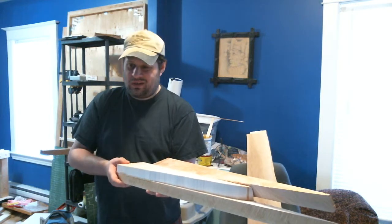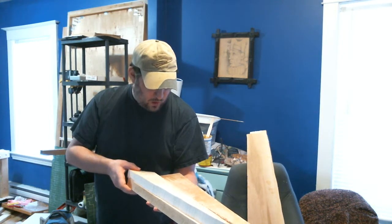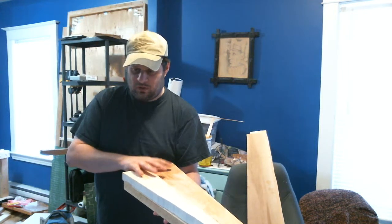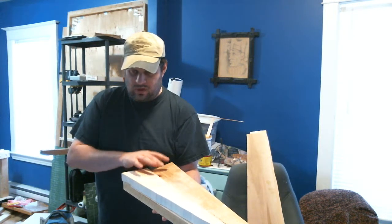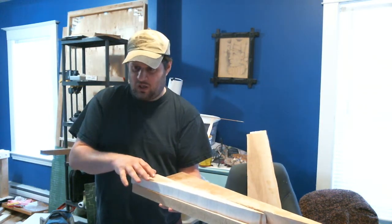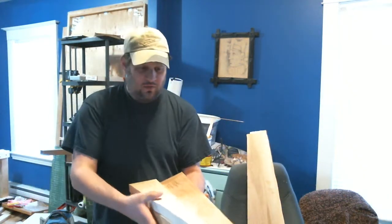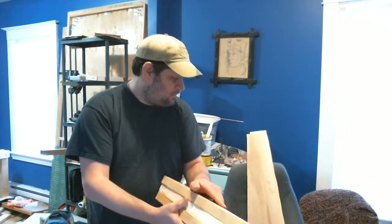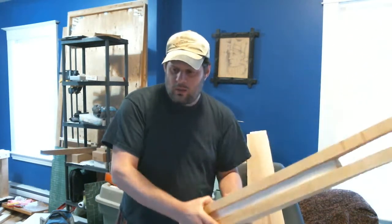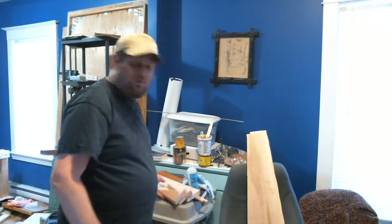I probably would have needed to use a lot more epoxy to do that, taking a lot more effort as well. The epoxy pretty much totally soaked into the surface — only a little bit squeezed out. And with epoxy, you need a thicker seam; you can't actually have it down to be an invisible seam. For polyurethane, you can. So I'm probably going to go with the polyurethane for this. I think I'm going to take those pieces apart and re-glue them with polyurethane, because I think it's going to come apart too easy. When I form a rifle out of it, it's probably going to break if I didn't. So I'll have more on that later.